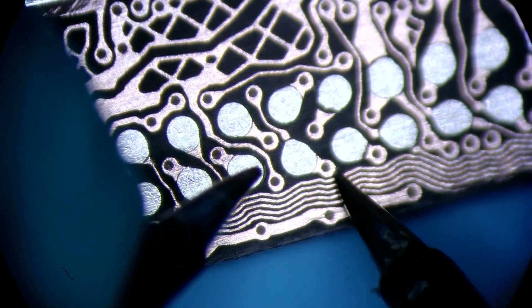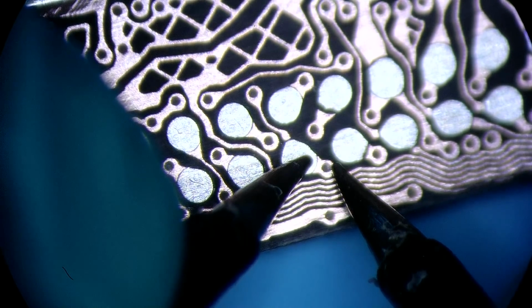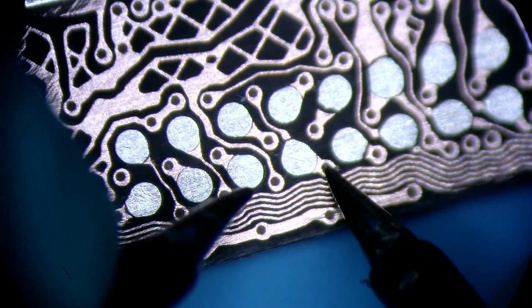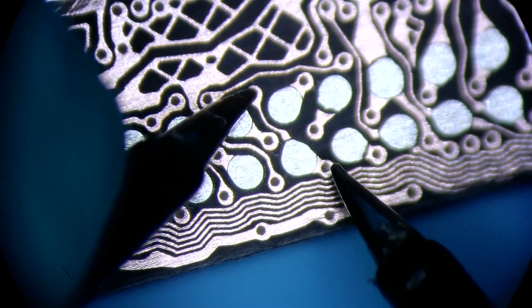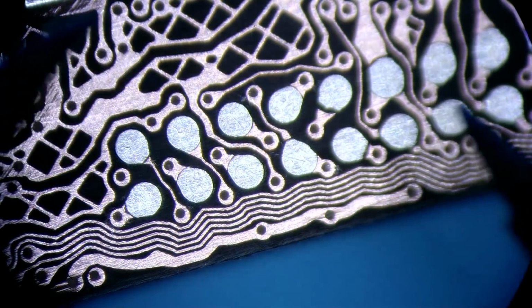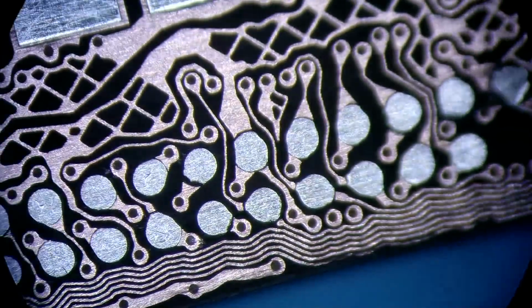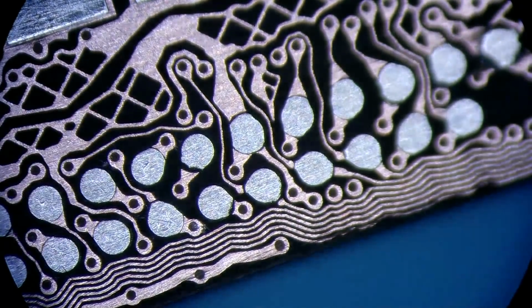If we go and connect to our pad here and the via, it's connected, but this obviously isn't, because we got a break right there. So now what happens is, wherever this cavity goes down to a different layer isn't connecting with this cavity that goes down to a different layer. So whatever this connection was supposed to be establishing is no longer establishing in that place. So that's critical. That's super critical to take care of, because that actually might be the only thing that's broken. Well, not really, I see some more.